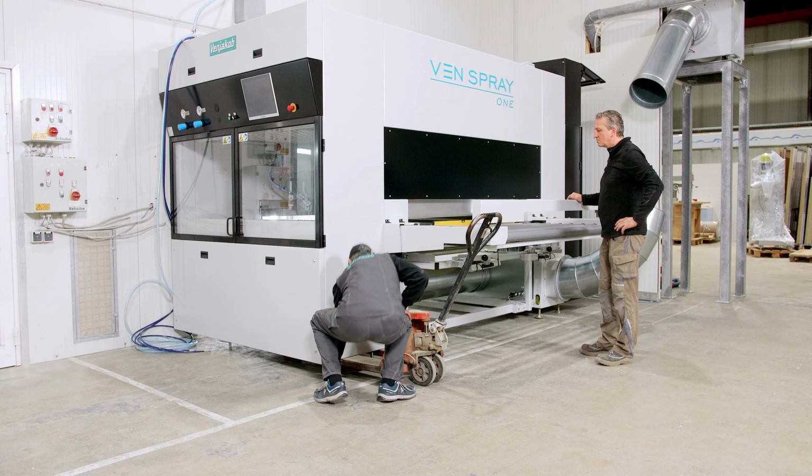The machine was unloaded with a crane, as you have just seen. It is not mandatory to unload it with the crane. You can also use a forklift. However, the requirements are that the forklift should carry 5 tons and have 2.5 meter long forks. Then it's no problem either. Then we'll show you how you can bring the machine into the basic position. We do this here with a pallet truck and a forklift, which are positioned under the base frame.